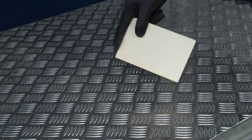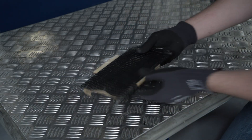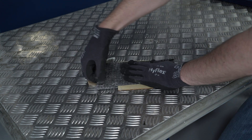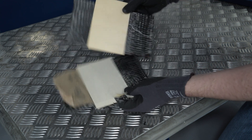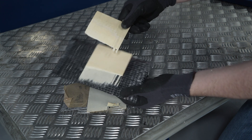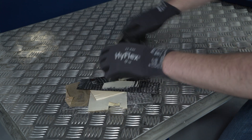Next, a natural option: balsa wood. This has compression strength far better than the foams, but is denser — albeit not compared to other woods. It will soak up a little resin, but not like an open-cell foam, and this impregnation may help the bond. The balsa failed, but this is not end-grain balsa, which I couldn't find in this thickness — it may not have split into sub-sheets otherwise. You also have to factor in balsa's moisture content, which may have implications in the cold, where ice expands and could buckle a laminate.